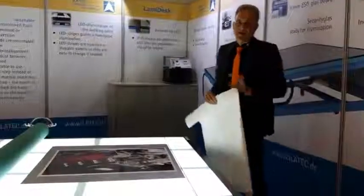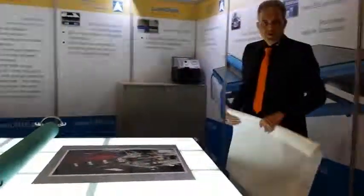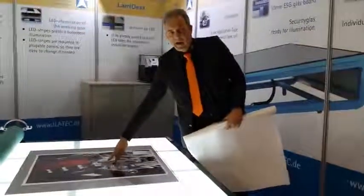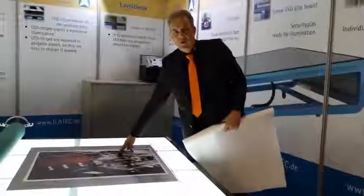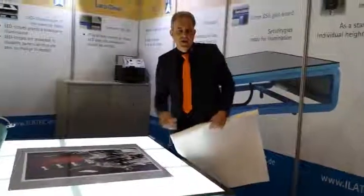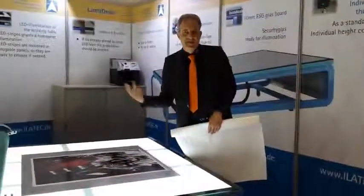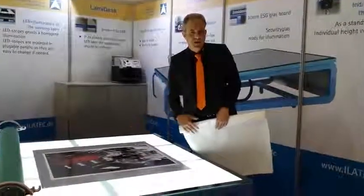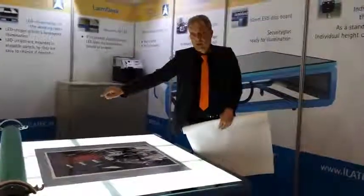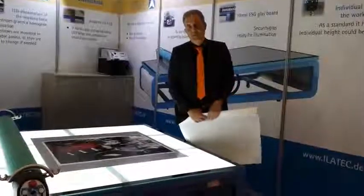It's very easy and very fast. One of the benefits is that when working manually you have to cut the release liner first, releasing half of the print. If it's 1.5 meters, that half of the print while releasing will have a static charge, giving dust a chance to settle between the print and board. With the motor driven version, only a small gap is opened and it runs continuously, so there is much less risk of dust between the boards.